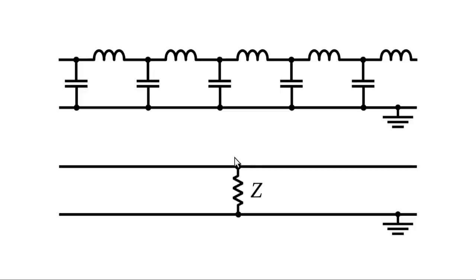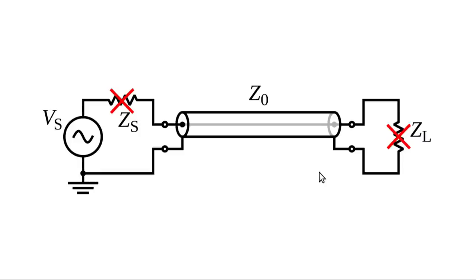Because the coaxial cable in the DS Logic has that 50 ohm characteristic impedance, when you attach the logic analyzer to your device you need to be aware that you're attaching a 50 ohm load, which will reduce the signal amplitude and increase the load on the transmitter. There's a second problem too — a transmission line needs source and sink termination resistors to prevent reflections, but the DS Logic probe doesn't have either of these. It's not really possible to add source termination without building something much more complex like an oscilloscope probe, and they haven't added any sink termination resistors inside the device itself, so there are going to be some reflections which could potentially impact the circuit under test.